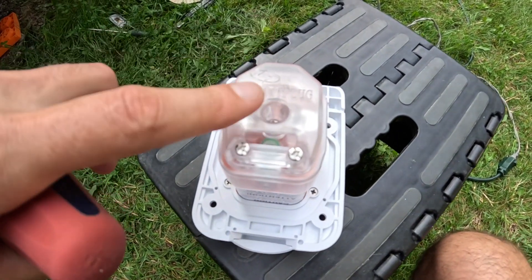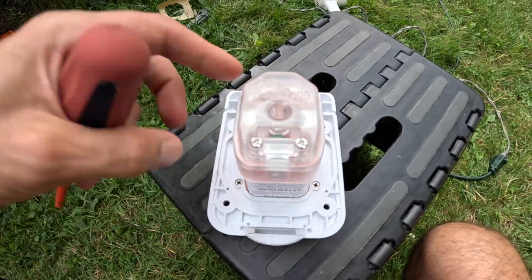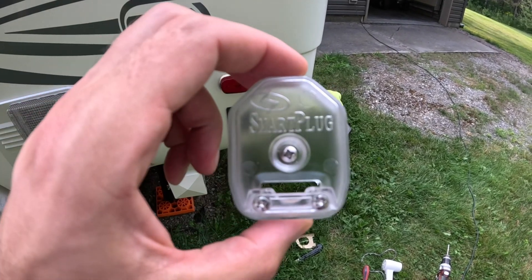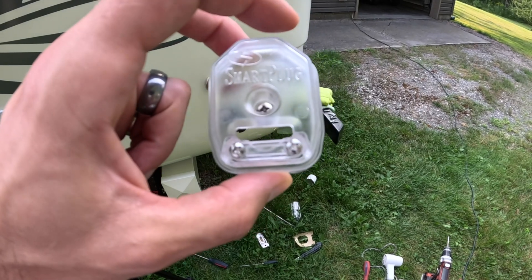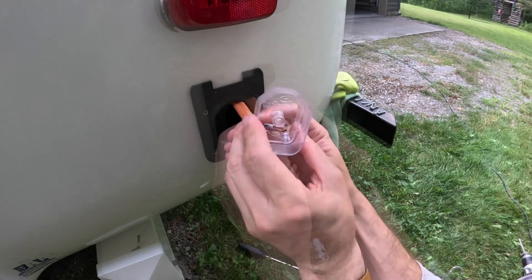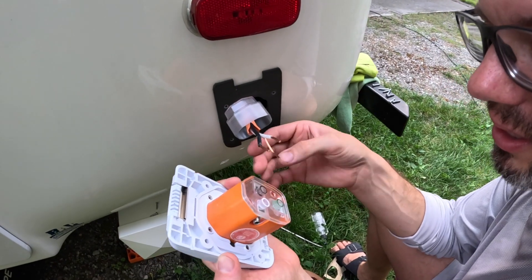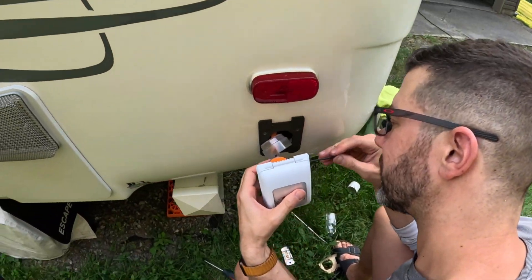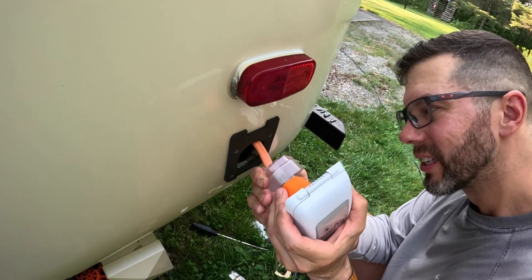In order to prep for the wiring, we need to take the cover off the back — there's a single screw to remove in the middle to pull the cover off. The two screws on the bottom you can pull those out just to make it easier to pass the wire through, so we're going to pass all three wires through the cover. The black connects with the black, the white with the white, and the green with your ground cable. Once all three cables are in, you use the allen key that was provided to tighten them in. The wires are good and tight.